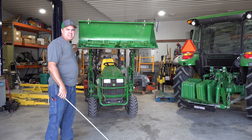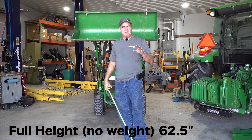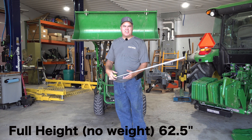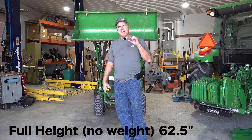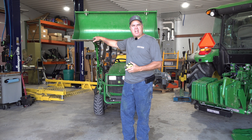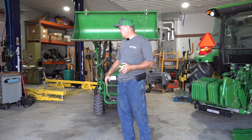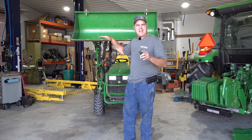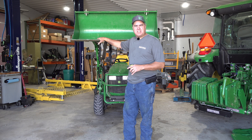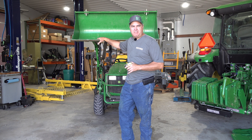I'm not sure if that's a spec they show — the lift height of bucket level. So with the bucket level and bucket empty, I'm seeing about 62 and a half inches. So I'm not seeing the three inch drop that I projected, but I'm seeing about an inch or inch and a half drop once the bucket is full. Tire squat — who knows what else makes it sag a little bit. 62 and a half, full height empty. Remember that — it's going to be a key figure when we put on the non-self-leveling.